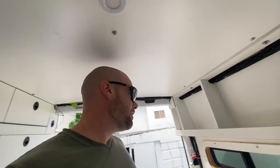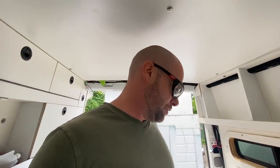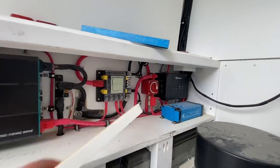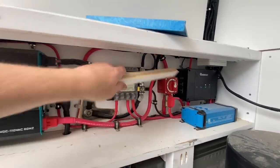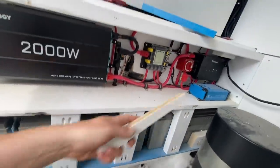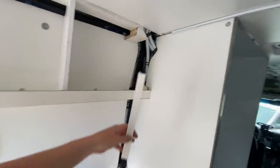And you have to have that, in this case, because this one's solar and that one's shore power. That was fun. That's one of Nick's next door neighbors. He just came by to borrow my wire crimper. He's sorting out something on his boat. And we had a discussion about terminal fuses, those kind of fuses right there and right there. That's a dual post one and that's a single post one. He was just looking at those, thinking that would probably be a better solution for what he's trying to do on his boat, which it sounds like it is.